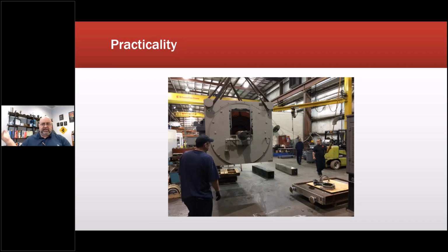We discovered that when we did the RCFA. Now, I'd been standing next to that thing when it was started twice, and when we looked at it, all of the material, all of the rubber, was gone. So we had conductors within half an inch of each other carrying 4160. Luckily, they did not start across the line or it would have been catastrophic. Pumping natural gas, and they were not explosion-proof machines. So if one of them had failed, it could have caused a catastrophic explosion, and if there were any personnel there, loss of life. So I went and worked with the OEM on the motors, got it resolved.